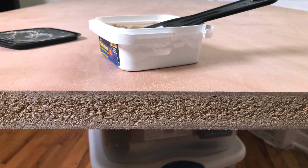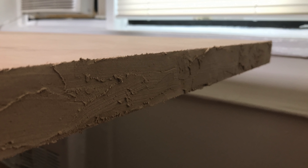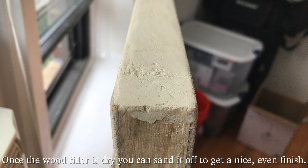I went ahead and finished and painted our tabletop so we can focus on the plumber pipe aspect of the build today. You'll notice from the images that the sides of the door where it was cut down to four feet had a lot of wood chipping as filler between the two pieces of wood on the top and bottom of its panels. I used some plastic wood filler to fill in those gaps, because painting over it without filling wouldn't allow for a nice even finish. I used something like a spatula to plaster in the wood filler to fill the gaps, then painted over that.